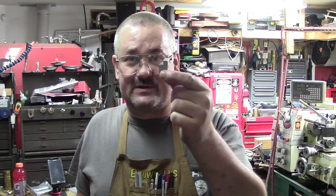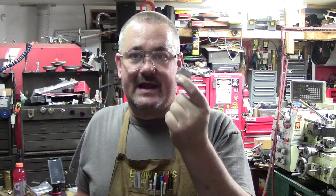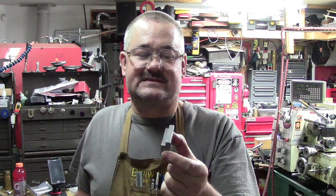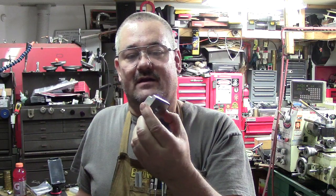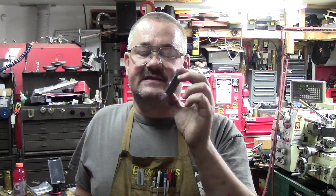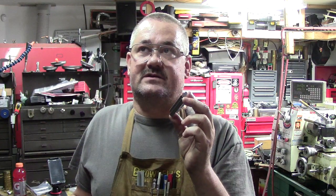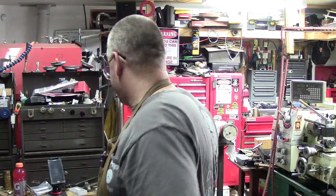their dimensions. Now this is pretty thick. General rule of thumb is 1 hour of soak time for every inch of thickness. So if that's 5/8 of an inch, I will go ahead and let that soak, because I'm going to do other pieces at the same time. I'm not going to do just this one piece, so everything in there is going to be generally the same thickness. That will soak at, let me think, off the top of my head, that's why I have an app.